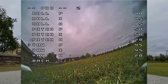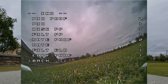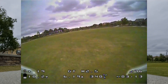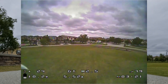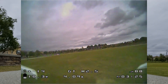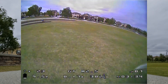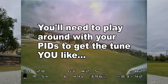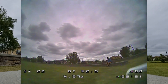Let's take the yaw P down to 40, and reduce the yaw D as well to 15. It sounds almost gone — that flutter is almost all gone now. My battery's about dead, so I need to swap out shortly, but I think I'm pretty much done here. This looks pretty good — that flutter is just about all gone, so I think I'm going to stick with this tune. That's going to do it for this PID tuning video. If you guys have any questions, let me know in the comments below.